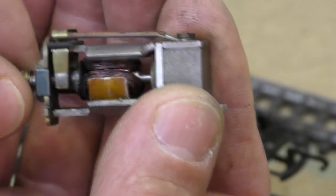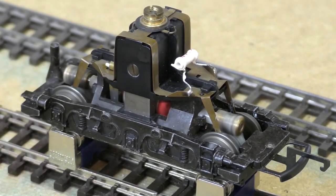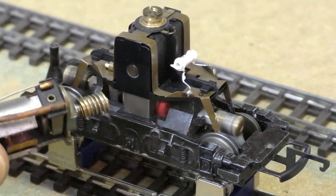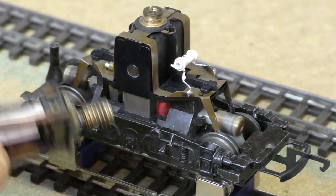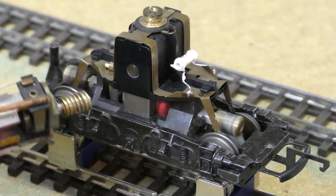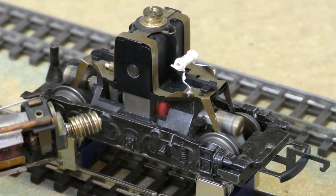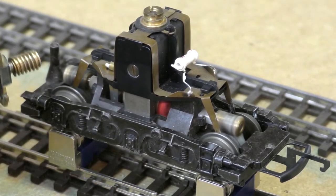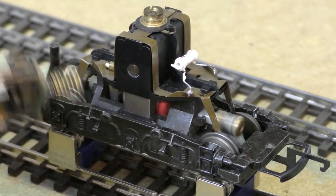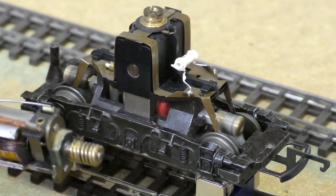I think you've probably got it by now. Looking at this bogie, we've got the brushes sure enough hanging down from the top — but here comes the problem. The pole pieces are not at the top and the bottom, they're at the sides. I hadn't taken this into consideration, so the armature I want to use is 90 degrees out on the timing. That's why it's not running. When the current's passing through the brushes into the windings, they're at the wrong angle to the magnets — so all I'm doing is drawing current and not causing any motion.